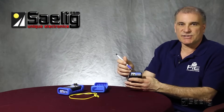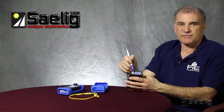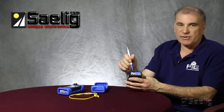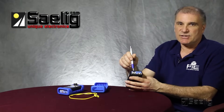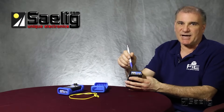Why am I telling you about this? The brass screws give us another important feature of our calibrator, which is stability. What we've designed in our cold junction circuitry is a brass block that provides a thermal mass. We use a high-precision thermistor that's thermally bonded to the brass block.